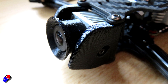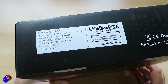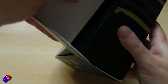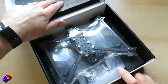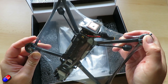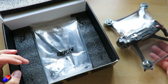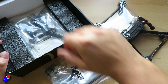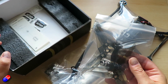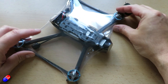It's only when you put the Crocodile Baby 5 next to the Mark IV that you can see how much thought and effort has gone into making this a really lightweight quadcopter. The arms are reinforced and covered at the top to protect the cables running out to the motors — a really nice touch. It has the full DJI air unit fitted and the latest GEPRC 2004 high-efficiency motors. Inside is a GEPRC F722 all-in-one flight controller; it's amazing how much of the space is taken up by the DJI system, with the quadcopter electronics itself being a single board at the bottom.